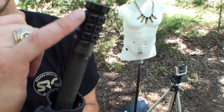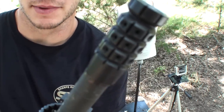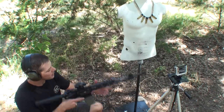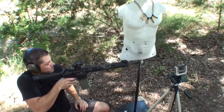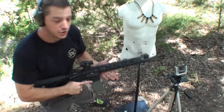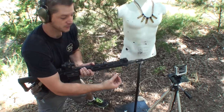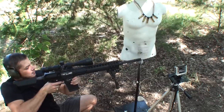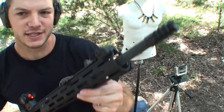Basically this row, this row, and this row are open. All the others are plugged up closed, so all of our blast is going to direct straight up. They kicked it way down. Normally when you shoot a gun, they kick up. So most muzzle devices are made to force that blast up. We obviously were just forcing way too much up, so the gun kicks down now. Let's try the .308. That one wasn't too bad, stayed pretty still.